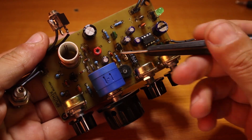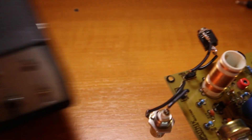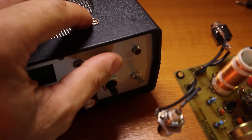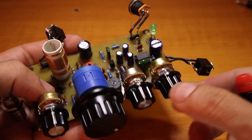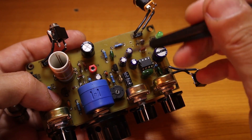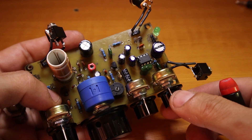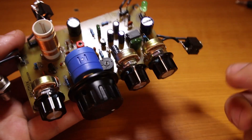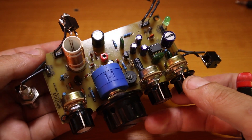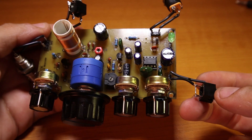There's no need for that switch anymore because right now I can do it in a simpler way. I also used to have an audio filter — a very simple rudimentary low-pass filter for CW — but now the way I built the audio circuit it sounds great both for CW and SSB, so no need for a separate filter unless you really want one externally.